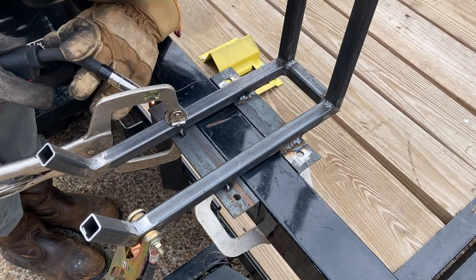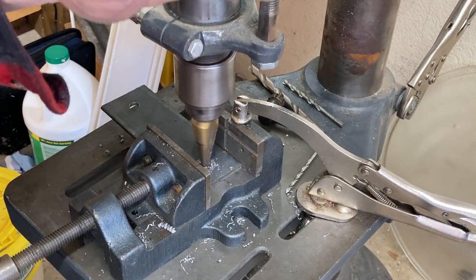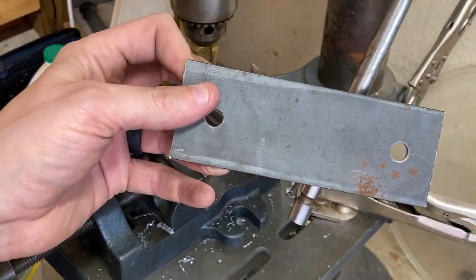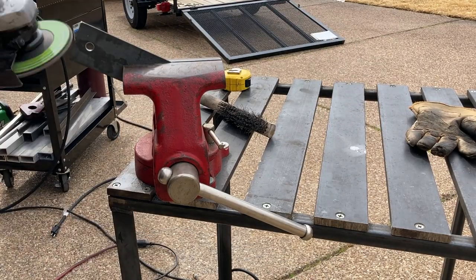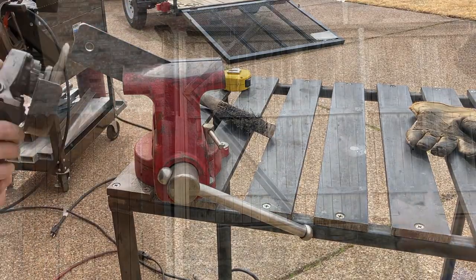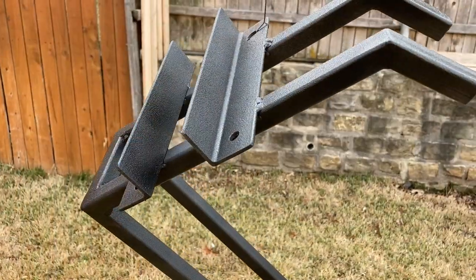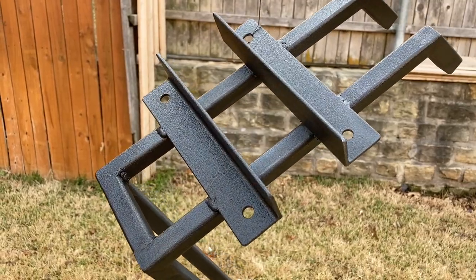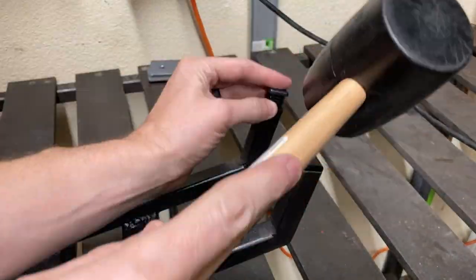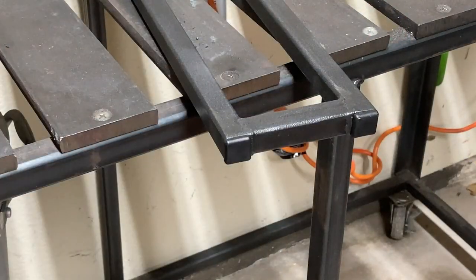I did find my step bit for this — drill another set of three-eighth-inch holes, three-quarter inches from the end but one inch from the side because this is two-inch flat bar. I didn't want any sharp corners, so I took my angle grinder and curved off all the brackets as well as the angle iron so I didn't catch the kayak. This is just black bed liner — I'm painting them because I want them to be fairly tough. I know it will scrape off as I remove them, but I wanted them pretty tough. These are just plugs; I didn't want to catch the kayak on anything — three-quarter-inch plugs. You'll put them on the J, and at the end there are also two open holes.